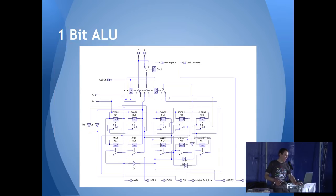So I came up with a one-bit ALU, which could use only 12 relays in the end. I realized that if I switch through every single digit in the register individually, and just have a little bit of memory that saves the ALU state as it goes through, I can do a serial ALU — so it does one bit at a time. This has the benefit of fewer relays but also variable bit width, so I could have it four-bit, eight-bit, or 32-bit if I wanted.